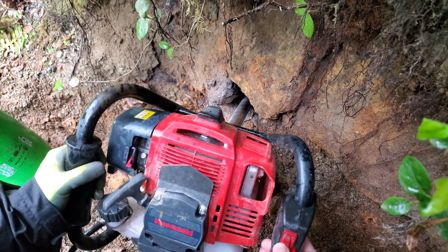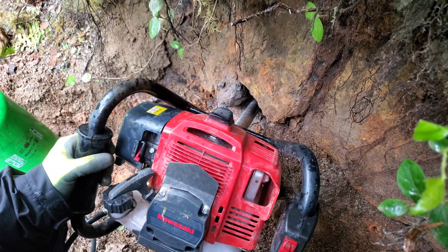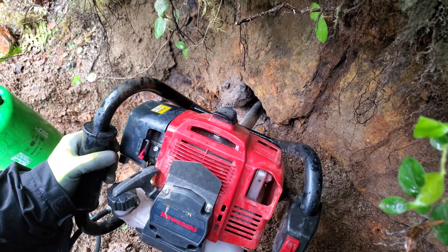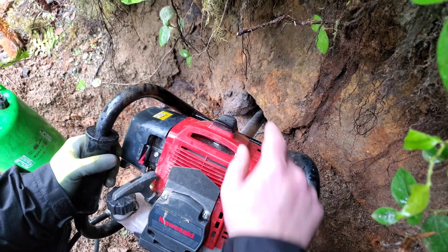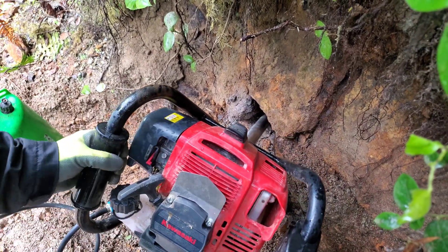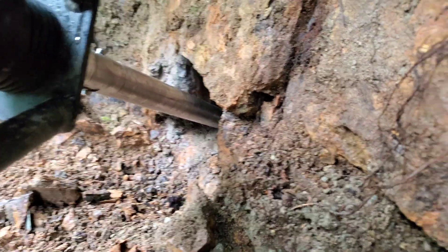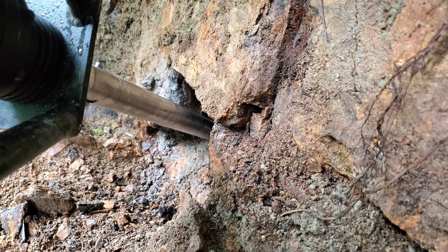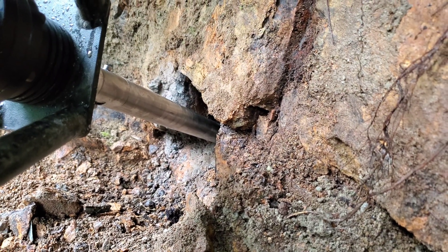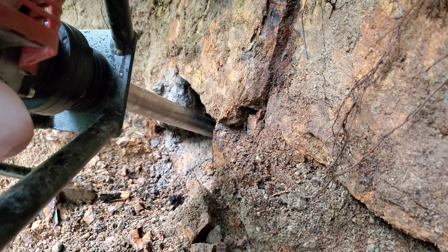I think that's it. It's taken us about two hours just to get in a meter and a half, just over a meter and a half. There's just too much fractured bedrock everywhere and stuff is sloughing down into the hole — too difficult. So we'll stop this one. We'll take a look at all the core we've already pulled out and what's left in here.